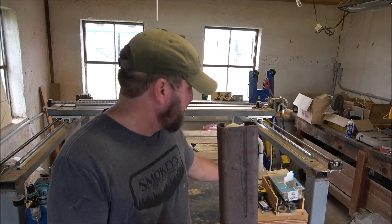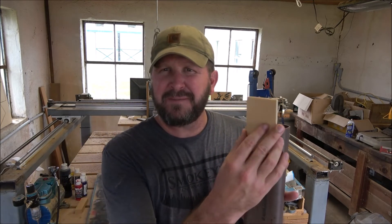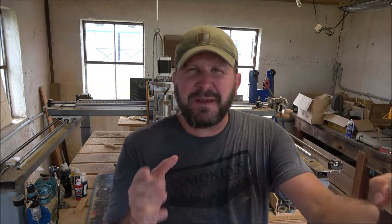I'm not going to tell you this one's 100% on, but it is very close. I spent days sitting there putting little dots. The welds on it that I overlaid are ugly — it's not like I'm a professional welder. But they're very strong; it'll hold and definitely take any kind of punishment I can give it out here. My advice: if you're going to use steel, I would not do a hard weld like I did. I would put ears on the steel, get a piece of your tubing and weld some ears up, so you can bolt the machine together. It's going to be easier to line up your bolt holes and get everything square than to fight the heating and contraction of the weld.